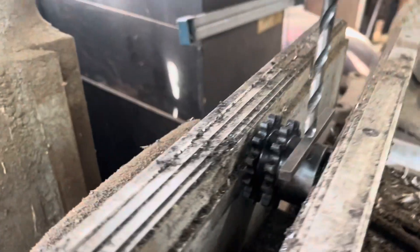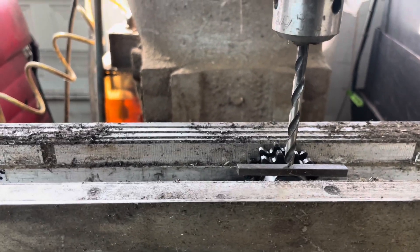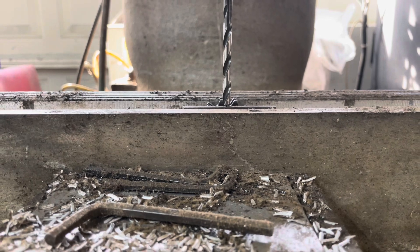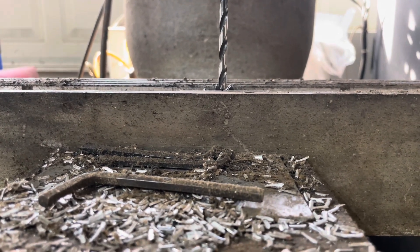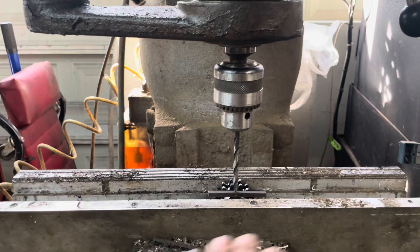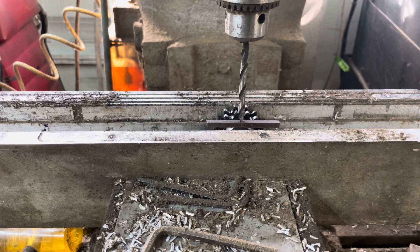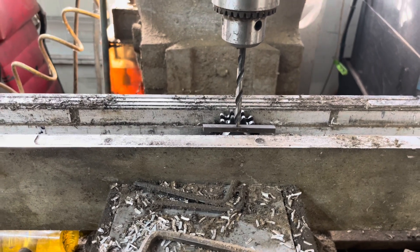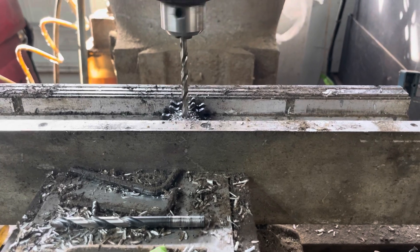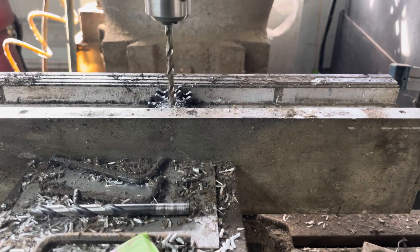We set up in the middle to put the pilot through the sprocket. Without a center finder to find the top of that arc, you can take a piece of shim stock with your drill bit, bring the Z down on it, and make it parallel to the top of the jaws — because the top of the jaws are machined level. When it's level, it has found the center of the top of that sprocket. Now I can retract and start the drilling operation. The first drilling operation is going to be the same size as our tap, and then one half of it I'll put a 1/64th clearance for the bolt.